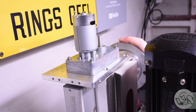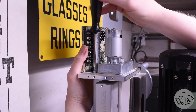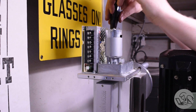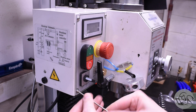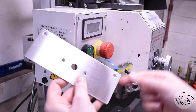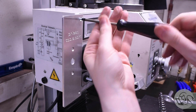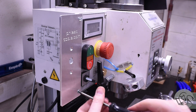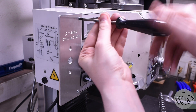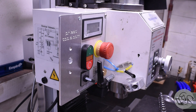Now a little test run — it's certainly engaging. You are cranking against the motor now, so you can still crank by hand but it's noticeably stiffer. The power supply then mounts behind it — I do like that this kit uses a modern switching power supply instead of the analog clunky rectifier silliness in the X-axis power feed on this mill. The control panel mounts on the front by removing a couple of trim panel screws. The instructions do say the holes may not line up depending on the production date of your mill, but in my case they do line up. That panel is super sturdy — I can shake the whole mill with it — and it doesn't interfere with anything else on the control panel.